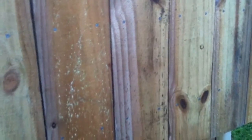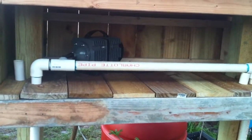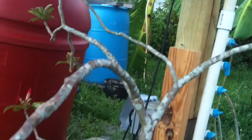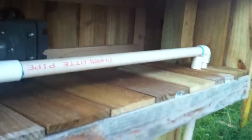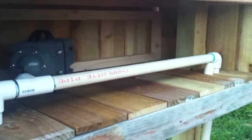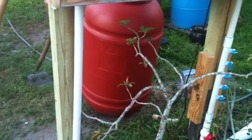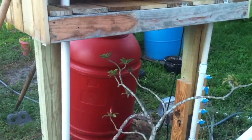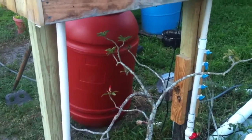This is that third pipe — the overflow pipe I was telling you about earlier. This is where all the water comes in from the settling tanks; the emergency overflow will go here, and the drains from the bottoms of the IBCs will go in there as well. Quick look inside the pump house — I don't have this on hinges yet, so bear with me. I have enough room in there to put in two more pumps, and I already had electricity run out here. There's a hole drilled at the bottom for the power cable. If I end up having more than one device in here I'll just put in a power strip. In the future I plan on doing a battery backup system — probably a rack with some batteries and an inverter — sometime in the future.